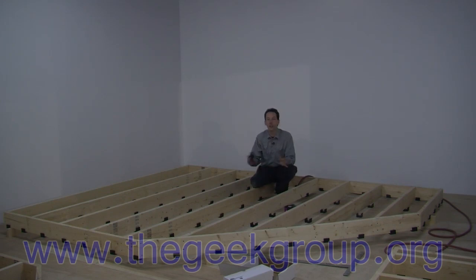Now, you've seen the videos of us working on this. We've got like 15 videos in the series on building the recording studio. We are now at the stage where the floor and the walls are done, the ceiling is done, and we're starting on the isolation booths. When you build a studio and you want really good isolation, you want to build a room within a room, so we're building three isolation booths. We've got isolation booth A and B here, these are the two big ones, and we have a small vocal booth which is just big enough for a guy to stand and sing. And we can use that for voiceover work and stuff like that.